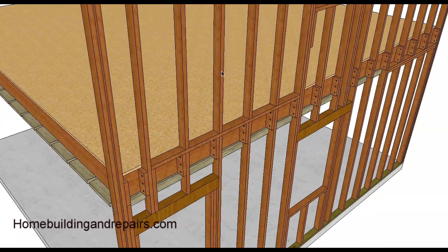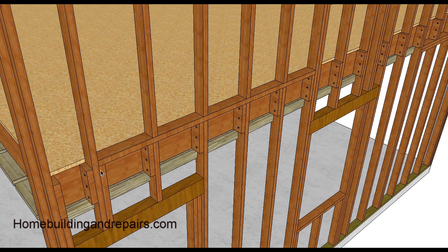Let's say you had some damage or wanted to frame a different window — you can simply cut the studs because all of the framing on the floor is providing you with the strength you need. It's not going to create a hinge point. If you need more information on that, I believe I have a video on that on YouTube. You can cut the studs all the way across if you have damaged studs to replace. You don't need to run these studs all the way down unless they're damaged and need replacing.